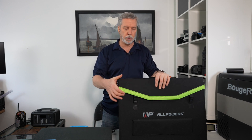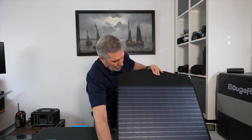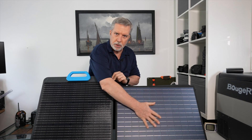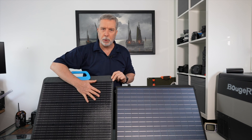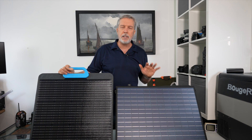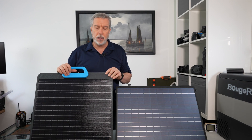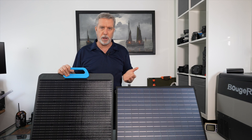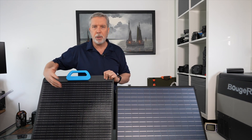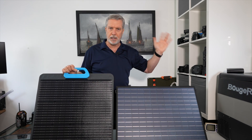You can see a difference in the panels themselves — the Bluetti has that marbled look while the AllPowers has a smooth surface. The AllPowers is very smooth to the touch, like glass, while the Bluetti has a pebbled ETFE texture. ETFE is supposed to keep that clear transparent look much longer. But realistically, these folding panels aren't meant to be left outside 24/7 — the nylon cloth that allows folding would break down anyway. These are meant to be used as-needed panels, not like glass panels you can mount and leave out permanently.